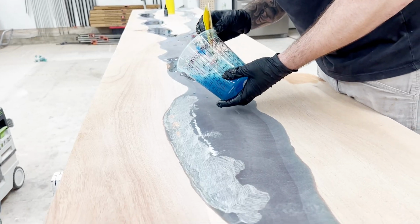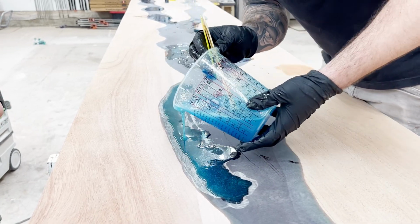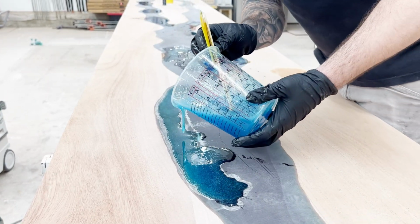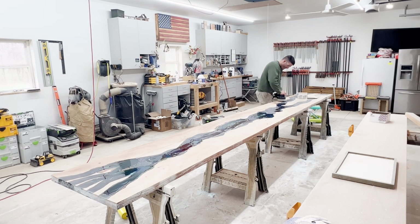For those of you that didn't know, if you find yourself in a sticky situation like ours, you never want to try and color match two epoxies. The end result is almost never perfect. Instead, what you should do is use a clear epoxy, as it will showcase the color below in a seamless manner. We probably should have watched a YouTube video before we decided to do this pour, because that mistake made us do it all again.